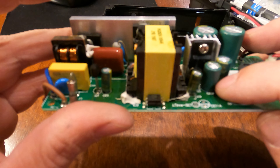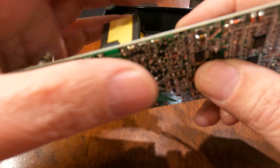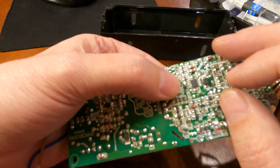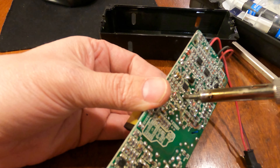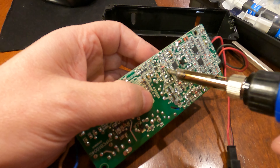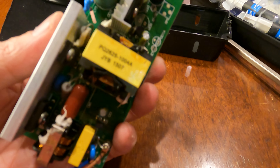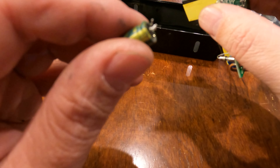Luckily I have some of these capacitors on hand. First I need to remove these capacitors - they're fried. I need to find their adjacent pins, which is always kind of fun. It looks like those two pins right there. I'm going to remove this one from the board and then go after its little brother. I finally got her to pull out - I am no expert at soldering, that took forever. Now I just need to extract the second one. Got the second one out. That took freaking forever.